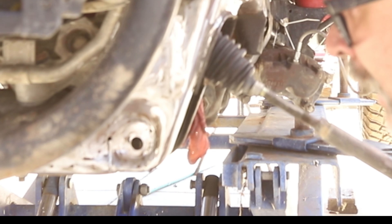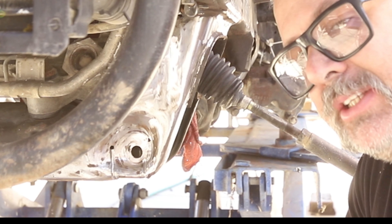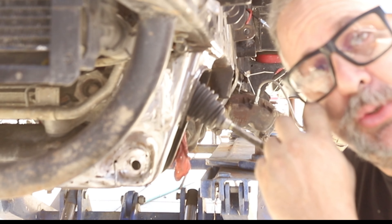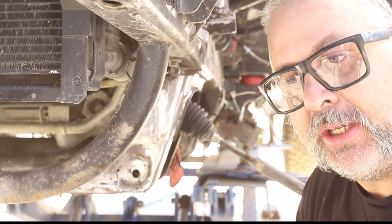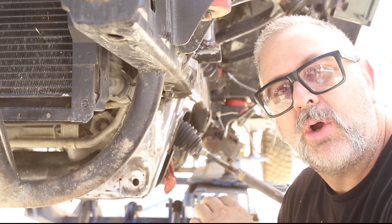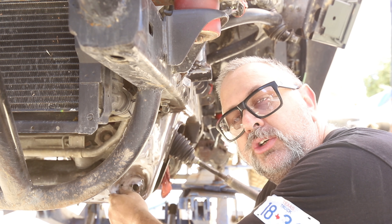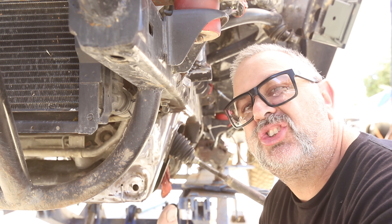As you can see, I stop-drilled this crack here. I also took my die grinder and dug out the crack, then I'm going to weld it in really hot. You always want to drill a hole to stop the crack from spreading — if you just weld over it, any part you may have missed will allow the crack to continue to propagate and only get worse. It's a game of finding the end of the crack, stop drilling it, and then welding it back in nice and hot.